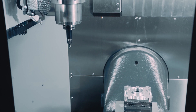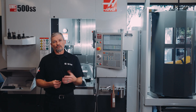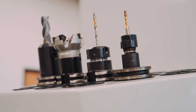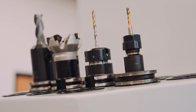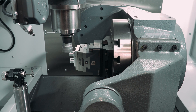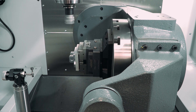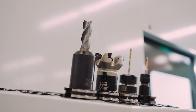The detection cycle can be turned on for any tool, and you'll typically only want it enabled for tools that have some chance of breaking. Small diameter drills, taps, and end mills are typical choices, and potentially other long narrow tools as well. A big end mill, a shell mill, or a shoulder mill probably don't need to be checked since the chances of visible damage will be low.